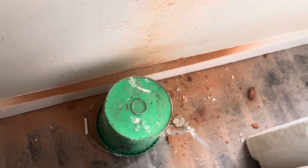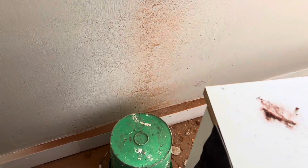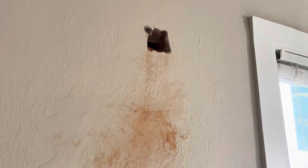Deep wall but we made it through - that's what matters. We're going to drill four holes and then chisel out the center. We got that all chiseled out and have a hole going all the way through now. I would recommend putting something down to protect the floor because there's a lot of brick dust - it makes a mess. Cover the area with plastic before drilling; that's how I'd do it.